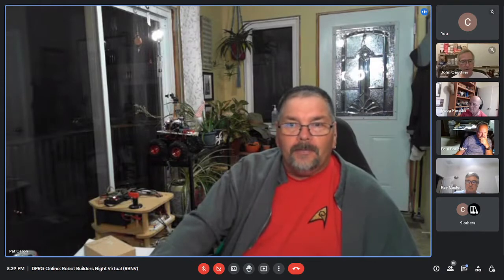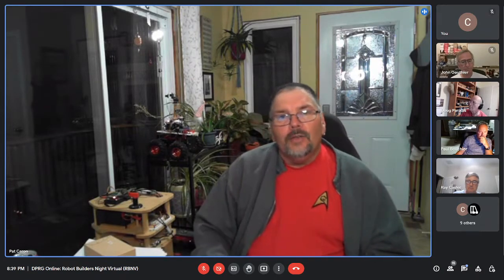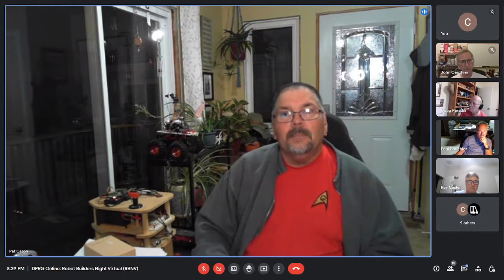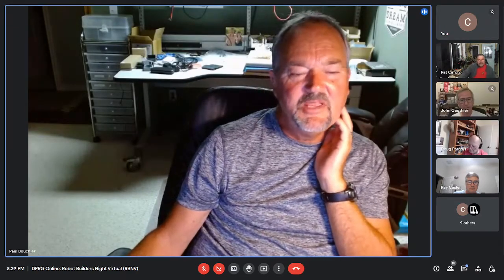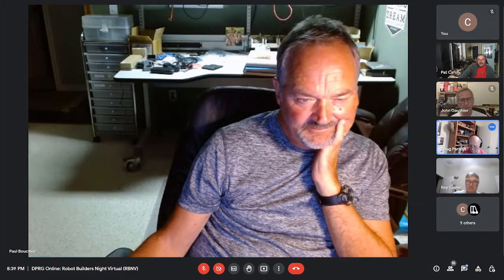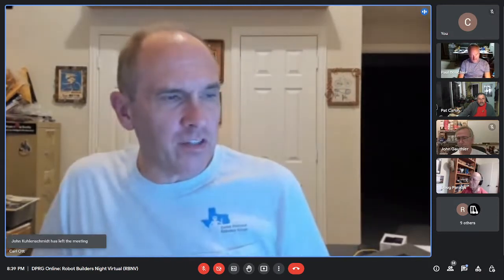Well, technically, even the clock line is considered bidirectional precisely because of clock stretching, right? I think the way clock stretching works is the slave at some point holds the clock line low, basically overriding the master. In that drawing, they show it as dotted out on the bidirectional buffer on the clock side. So I'm questioning, how do you do clock stretching if that's the case, if it's disabled or whatever it is in that circuit? The question is, what does the dotted drawing mean? Well, that PCA9605 is probably bidirectional for each of its pin pairs, right? So could the dotted line mean that it exists but it's not used?